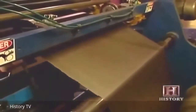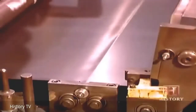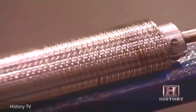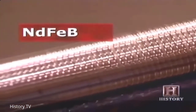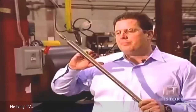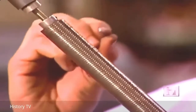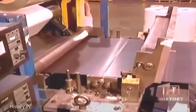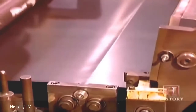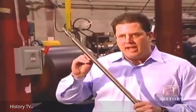But now it's finally ready to pass over the simple device that'll turn it into a magnet — a roller consisting of powerful permanent magnets classified as rare earths. These particular rare earth magnets are neodymium iron boron, and are positioned such that their north and south poles alternate along the length of the roller. Before the sheet passes over this roller, the small ferrite particles are not aligned magnetically in any form or fashion. As they pass over it, the field produced by this rare earth magnetic roller aligns those little particles in the sheet to create a magnetic pattern — a mirror image of the magnetic pattern on the roller.